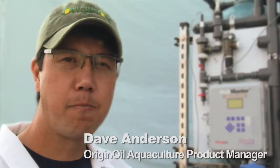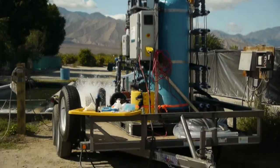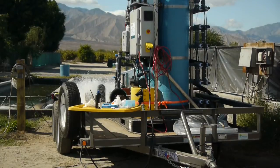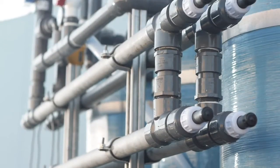So this is the Aqua Q60 — it's for ammonia removal and disinfection. The footprint is extremely small for a machine that operates at 60 liters per minute. It scales very easily; all you have to do is add larger filters and more electrode tubes.